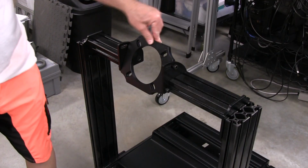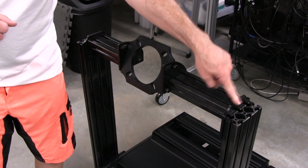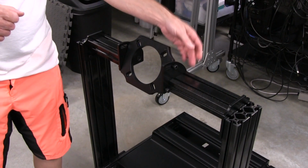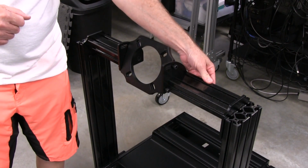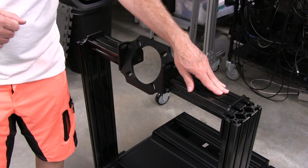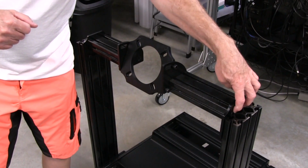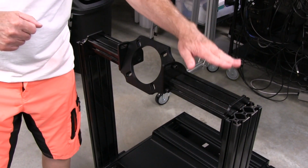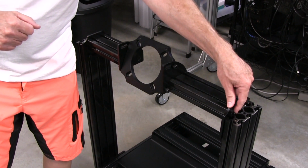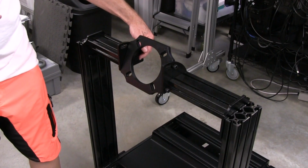So now what we're doing is we have a 6mm thick metal plate here. This is steel. And we have a steel plate over here. And they are being bolted to this piece of profile, a 1.5 by 3 inch profile. 2 channels, and of course you can see it's mounted flat. Now, we have some flathead bolts back here so we can raise and lower this anywhere we want to without interfering with our profile here. If we had a bolt sticking out, it wouldn't work, would it? And we have flatheads back here. I think you can see one sticking down there.